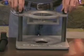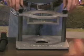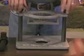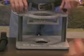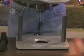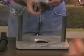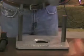The pitch that we're looking for is a 1/4 inch left by a 1/4 inch reverse. In order to get that, we need to use the number 5 plate, which I have installed on the jig. So we're going to install the 1 3/8 inch drill bit into the pitch plate.